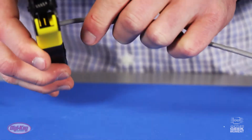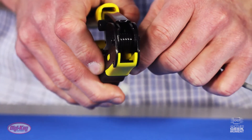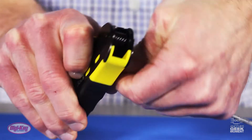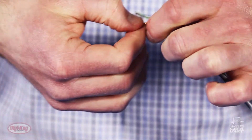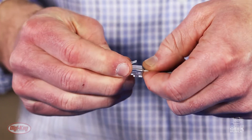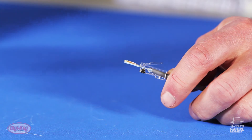I'm going to take the other end of my cable, do the same thing — we're just going to cut it off flush and strip the jacket back. Klein recommends one and a half to two inches. Strip the jacket back, got a good score there, twist it off, and undo my twisted pairs. As you can see, the wires are running long through the pass-through RJ45 connector.